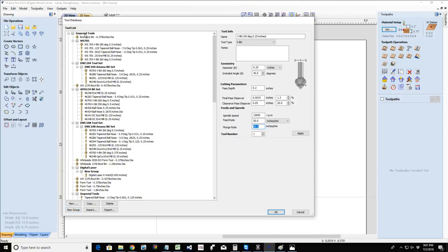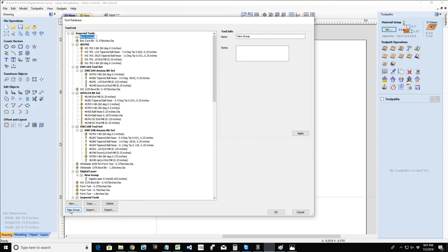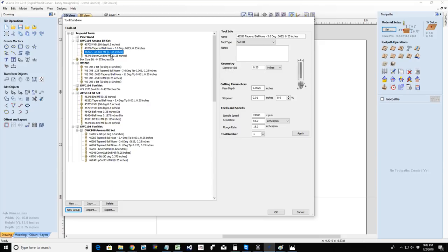So if I click on Imperial Tools and type in new group, I can type in pine wood. And then under that group, I can have all of my tools and their proper settings for the feed rate and the plunge rate for those tools. So I'm going to have my tools in the tool chart 6 or 7 times over, but in the general woods that I'm usually carving in, I'm going to have that list: pine, poplar, walnut, maple, cherry, mahogany, the woods that I generally work in all the time, plywood, right? Plywood, which falls under the softwood category, but still plywood,